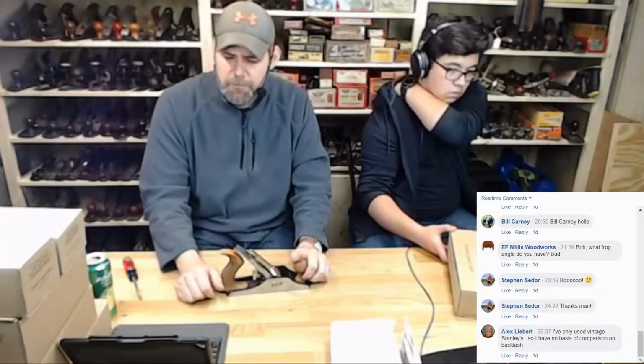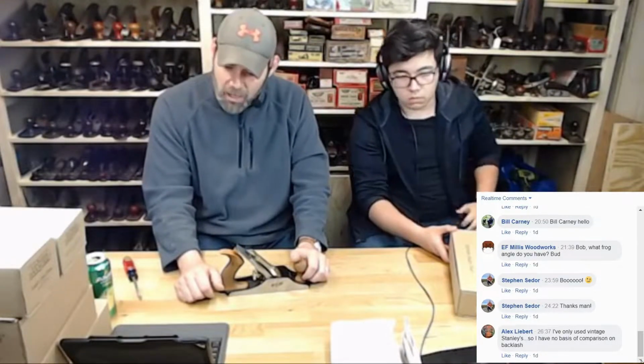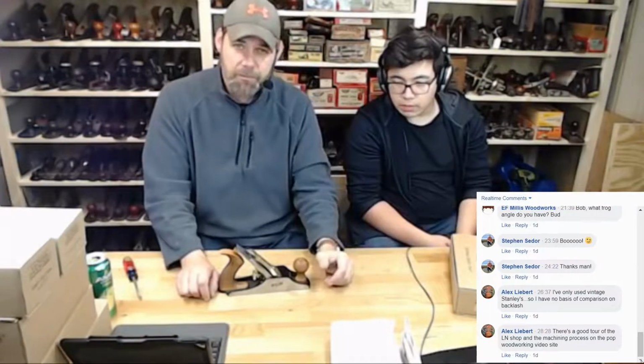Yeah, Alex, it depends on the era of the Stanley. Some of the Stanleys have more backlash than others. Some of them are horrendous, and then some of them are pretty tight. Same thing with Miller's Falls, same thing with Sargent. Any of the vintage plane manufacturers, you're going to find it varies. It depends on when they made it, and it also depends on how much has been used. You're talking about a 100-year-old plane, it might have been used for 40 years on a bench every single day. You're going to get wear in the components. So there's going to be more slop than there was when it was found in a box from the same time period, if that makes any sense.